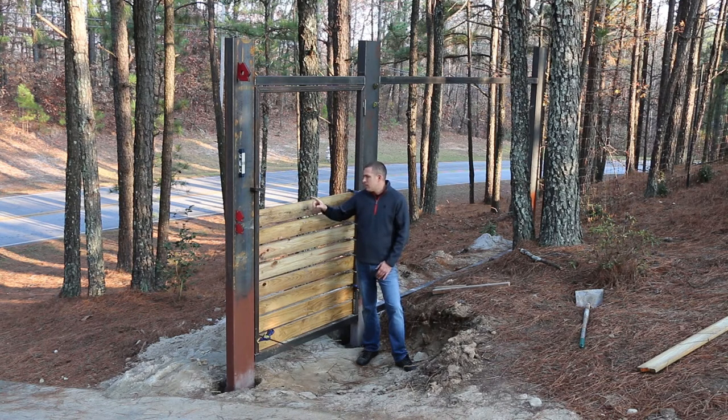Since I'm only drilling through into the back side of these boards, I'm gonna put 3 screws in each, going all the way down, accounting for this spacing. I'm just going to drill them on the mill. I think that's going to be the best way to go. I'll load them all in the Tormach. I've already got an idea of how I'm going to clamp that up to run at least three, maybe six of them at a time, so I can drill a whole bunch of holes real accurately, fairly quickly. So in the next video, I'll drill all those.